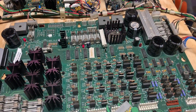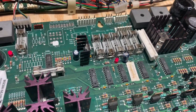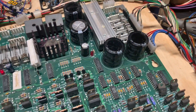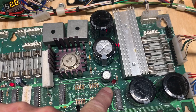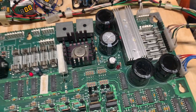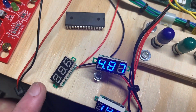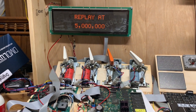The second of a pair of WPC power driver boards. I did the same thing to this board as the prior one — C2 and C4 were replaced, C5 was replaced, headers all the way around. This one's interesting: LED 6 is not lit. That's a 12-volt LED — this is probably 18, I don't remember — and you can see that my 12-volt indicator is not lit.